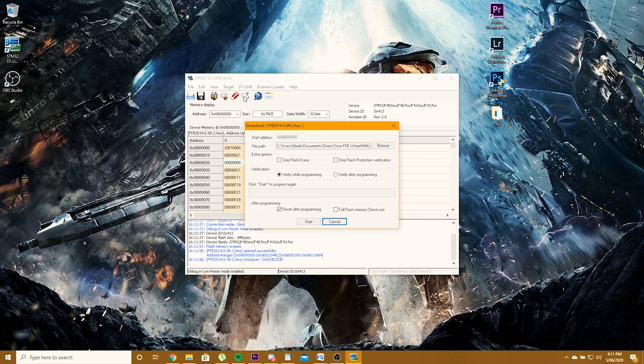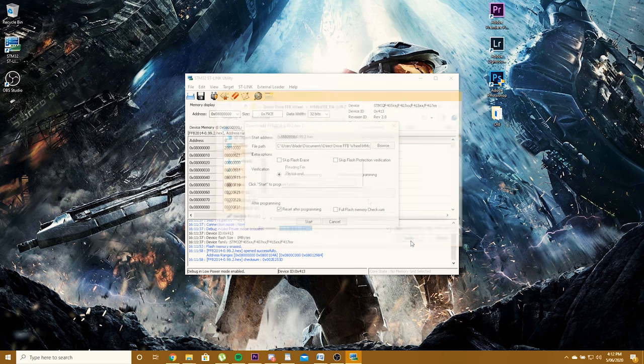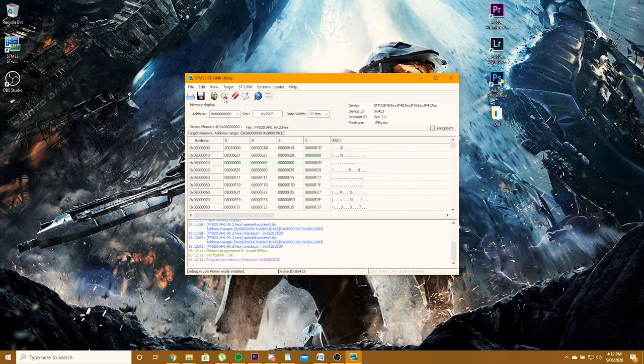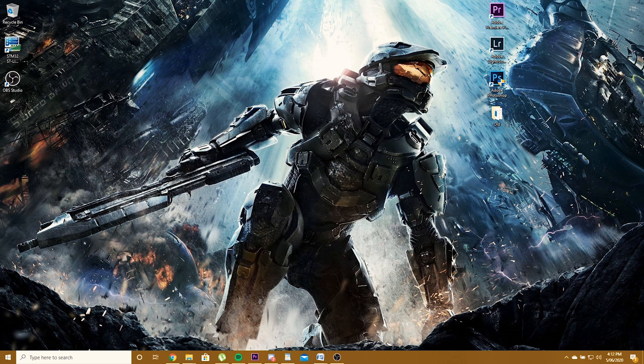All right, so now we're going to want to program and verify, put the path to the MMOS firmware hex file. All these links will be in the description. Okay, now we're going to go start. It's going to flash. And done. Now you can disconnect from target, and we're going to plug in the micro USB side and open the MMOS software and see if we can get some connection.